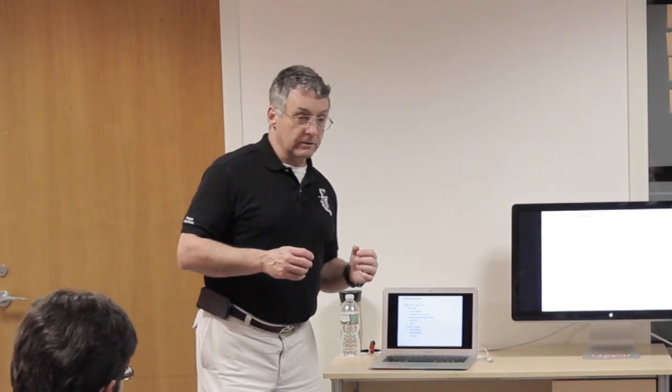That's less picky. The grooves can be a rectangular groove, like I showed. It can be a full dovetail or a half dovetail. Dovetail grooves have the advantage of retaining the O-ring. In all the semiconductor processing equipment I used to build, we had O-rings, I mean, 10 running feet of O-ring around this funky chamber and a big lid that comes off on a hoist. And O-rings are sticky, especially when they've been compressed and subjected to high temperatures. You don't want the O-ring to be torn out of the groove when you pull the lid off. So you put it in a half dovetail or a full dovetail that retains it.